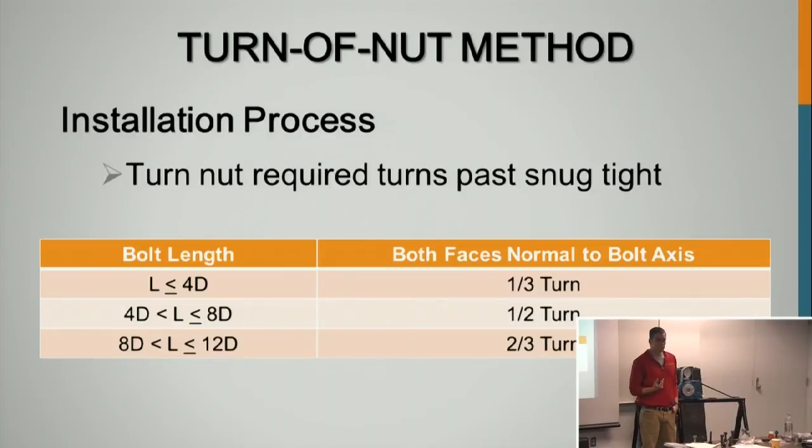What's important with this: if you're having 16 or 17-inch bolts, which is what they were using for that truss we've been showing, they're going to be sticking out very far. The Skidmore will work for that. You want to use something to prop up that bolt, because these two little ears right here can easily snap off. I know Jerry's seen a couple, and the people at Skidmore have had to replace a bunch of them. So just be careful, but you can use up to any length, using the washers, and they sell special little bushings so you can stick the bolts out as far as you need to.